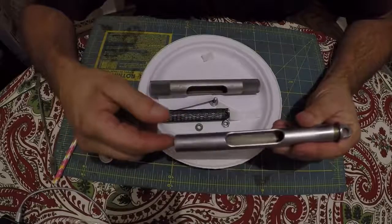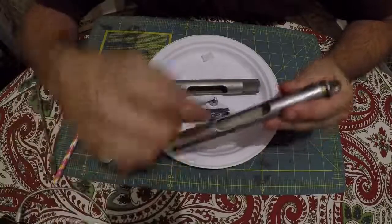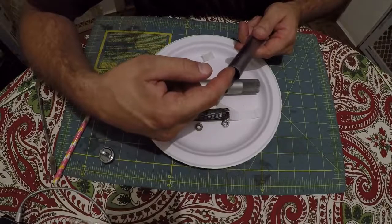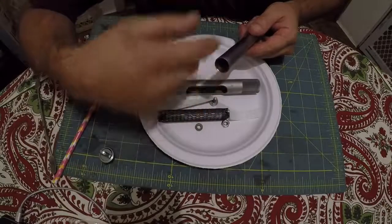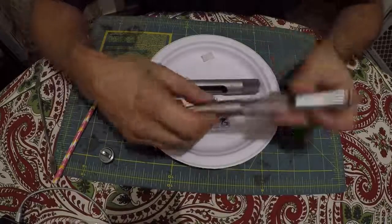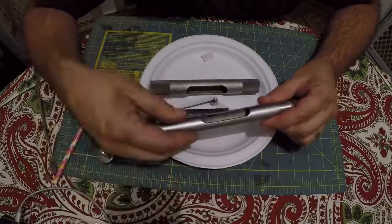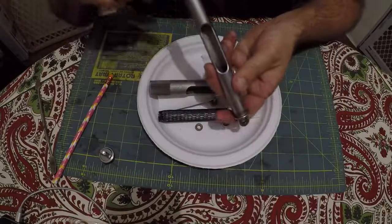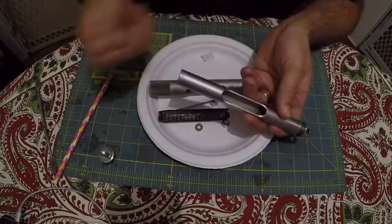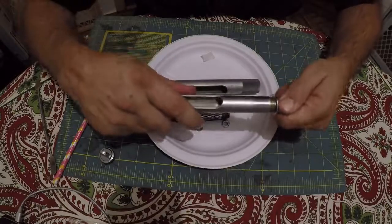Anyway, once you got one side out, you don't want to try to grab hold of this. You might crush this tube or distort it. You don't want to do anything like that. So just work at breaking out this vial and find a drill bit or something like that that will just fit inside of here, and you can kind of bore out. Hopefully they're using plaster or something like that. You can kind of just work that out of there. Use a punch maybe at the very end, knock out the bottom of the vial. That should work. That's what I did. Once you got it out, if you can't get a hold of this and pull it out, you could use a punch and just slide a punch all the way through, and just tap it out, and it should come out without too much trouble. So that's how that's assembled.